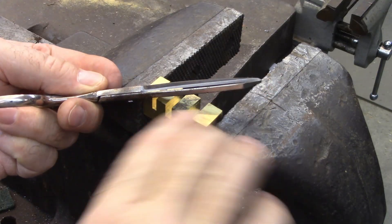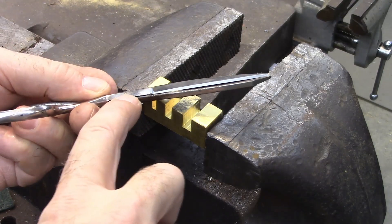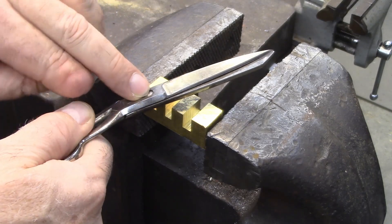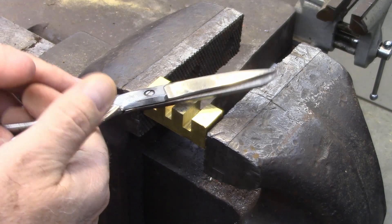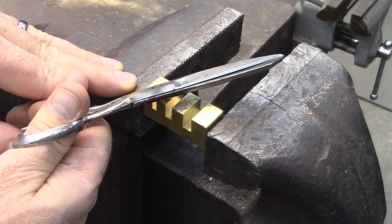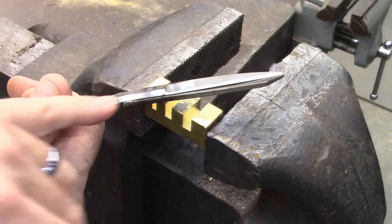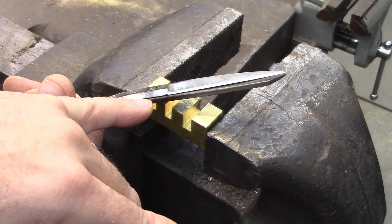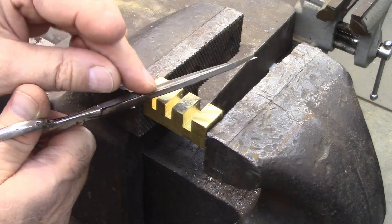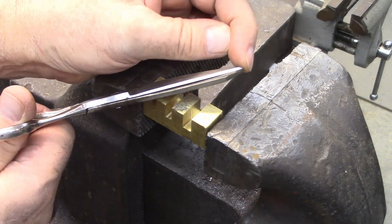So if you don't have the proper situation — the two arcs touching at the tip with a gap at the screw — you're going to have to adjust that. First, set your gap at the joint: loosen the screw until you get 6 to 12 thousandths right there. Then put them together and check whether you've got a nice, even, gentle arc with the tips touching.